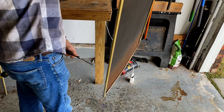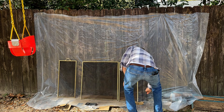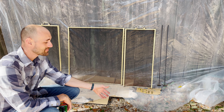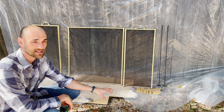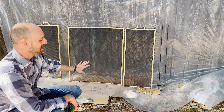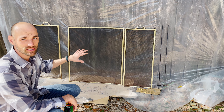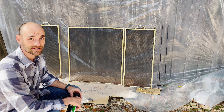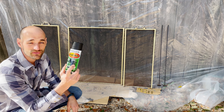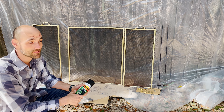To set up your painting area, you can use painter's plastic like I did, trash bags, or even a drop cloth attached to your fence with a couple nails, screws, or staples. I have everything prepped and ready to paint with the underside of all my fittings turned up so I can paint those first, then flip them over — no one's going to really see them. I'm going to paint the back of the fireplace screen first, then flip it around once it's dry and finish the front side. For this project I'm using a Rust-Oleum flat finish product used for barbecue pits. There is a semi-gloss if you want a different sheen, but we're going to use the flat for this project.